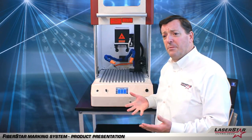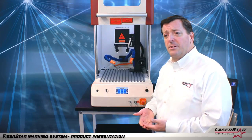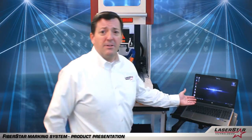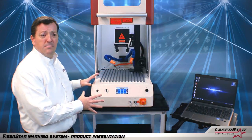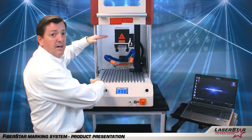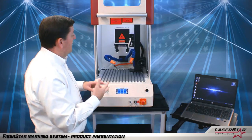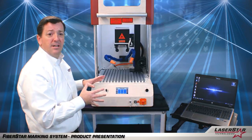We have multiple trigger capabilities to fire the laser. We have a marking button here. The laser can also be discharged with a foot pedal, depending on how it's configured, or through our software laptop system. These are some of the highlights of a compact, air-cooled 3800 series marking system. It gives you about 20 inches of width, and a variety of height depending on the F-theta lens, available in 100, 163, and 254 lenses. Machines run on 110 or 240 volts and are really the standard of today's marketplace.